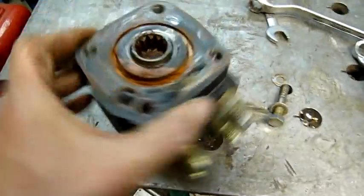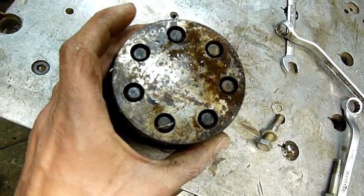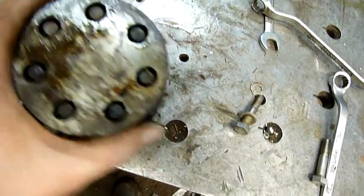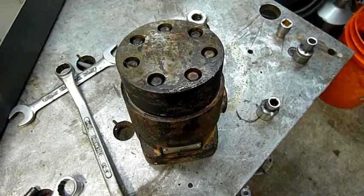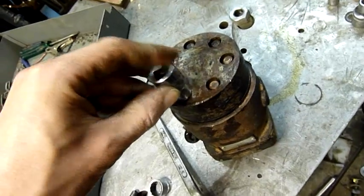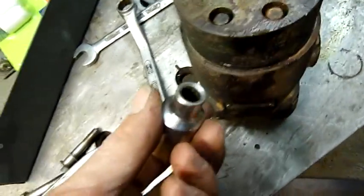The main thing is trying to strip this down, which is going to be fun because those screws have about 12 slots on them. They're not normal Allen screws or hexagonal screws or anything like that — they're going to be rather nasty. I don't even think I have a driver to remove them. These fittings are all pretty much trash — they're burred, dented, scratched. As soon as you get a scratch on one of these hydraulic fittings, they just leak. So these are all useless. I should try and measure these with the vernier and risk machining one of these sockets down thin enough to fit inside that recess, since they don't counterbore them big enough to get a normal socket over those screws.